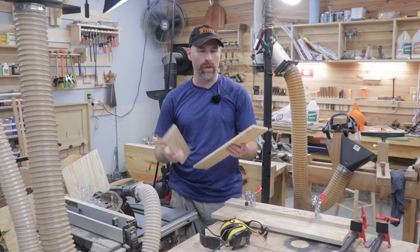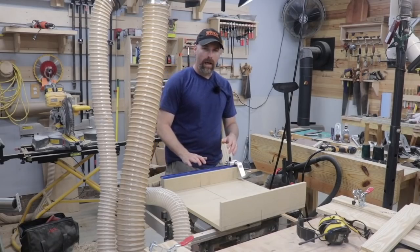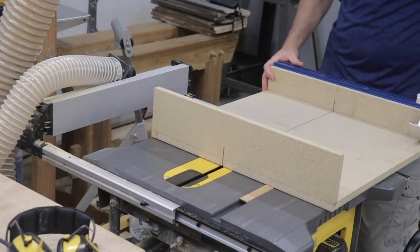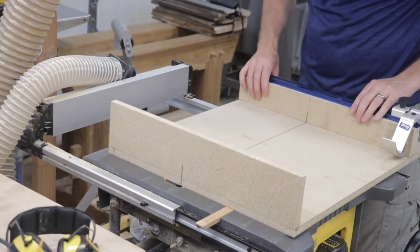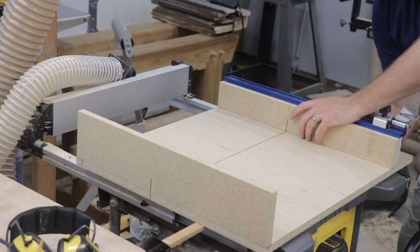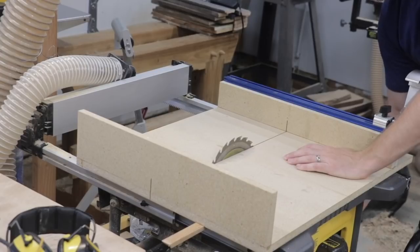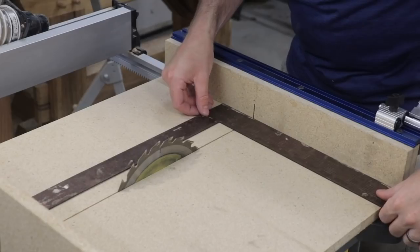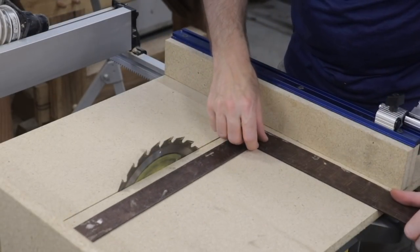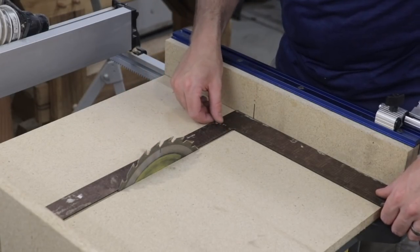Once we get the boards edged using the joiner sleds, we need to actually cut the pieces to length and have a perfectly 90-degree end on them. I made this table saw sled in order to cross-cut the pieces to length and do that in a reproducible fashion. The table saw sled works basically the same way as the joiner sleds, except it has a fence that is perfectly 90 degrees to the blade. There are a bunch of complicated ways to line up the fence to your blade, but I just went ahead and used my framing square — that's what I use for every project in the shop, and everything is basically built off of that square.